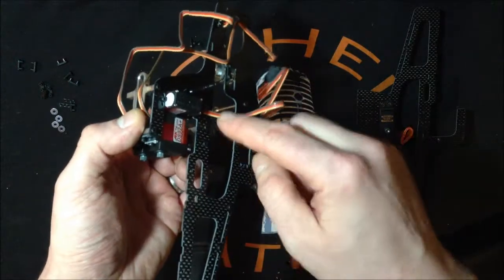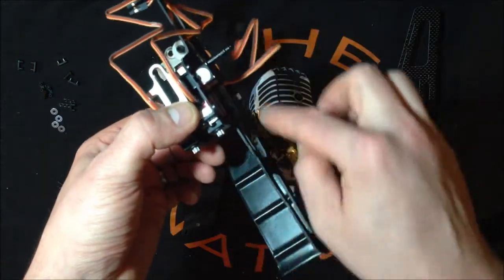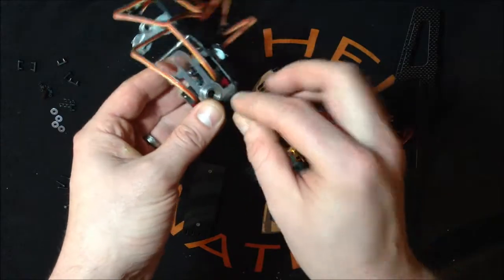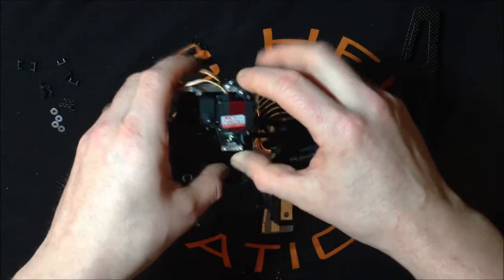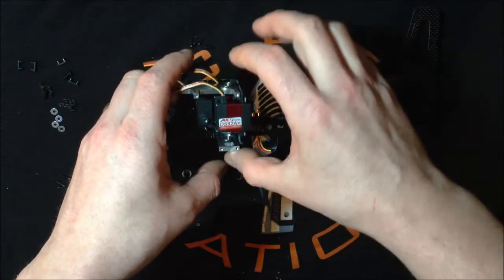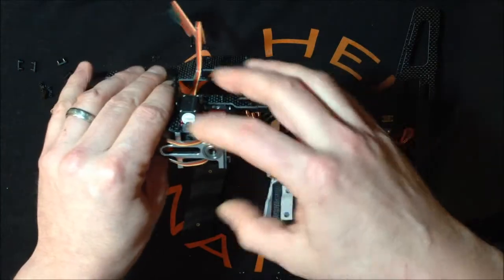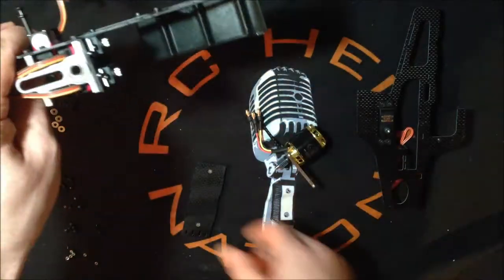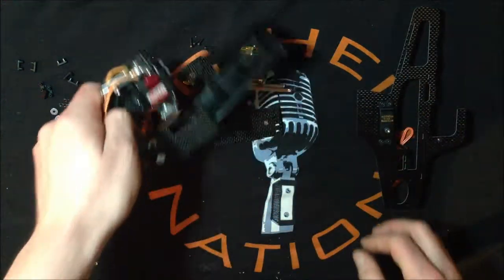You've got these basically 1, 2, 3, 4, 5, 6, 7, 8 screws, and just go around and tighten those in a star pattern. Make sure each time that you don't cause the motor to stop moving smoothly through that whole set of bearings. You want that shaft to move nice and smooth. So we'll go back, we'll do that, get these all nice and tight, show that the shaft is still moving smooth. Then we're going to put this piece on, and then we'll move to the motor mount and show you all of that when it's done and ready to go.